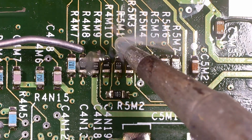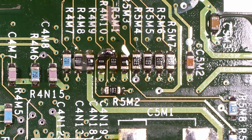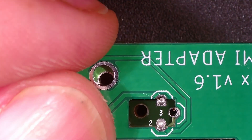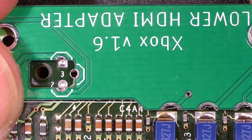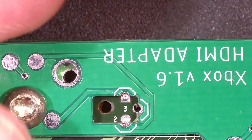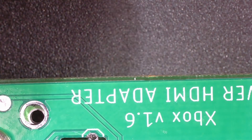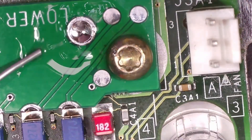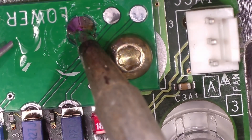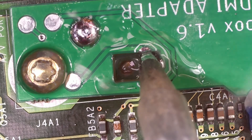According to the instructions — there'll be a GitHub link below — these two resistors need to be bridged together, which I believe tells the Xbox that it's connected to a component cable. There are two adapter PCBs: the v1.6 and one to cover the other models — three altogether. Since I've got the 1.6 I'll use the 1.6 adapter. This is going to line up and we're going to solder it to the board to keep it in place. I put the screws in first, as recommended, to hold it so it doesn't move around while soldering — there are about six or seven points to solder in total.